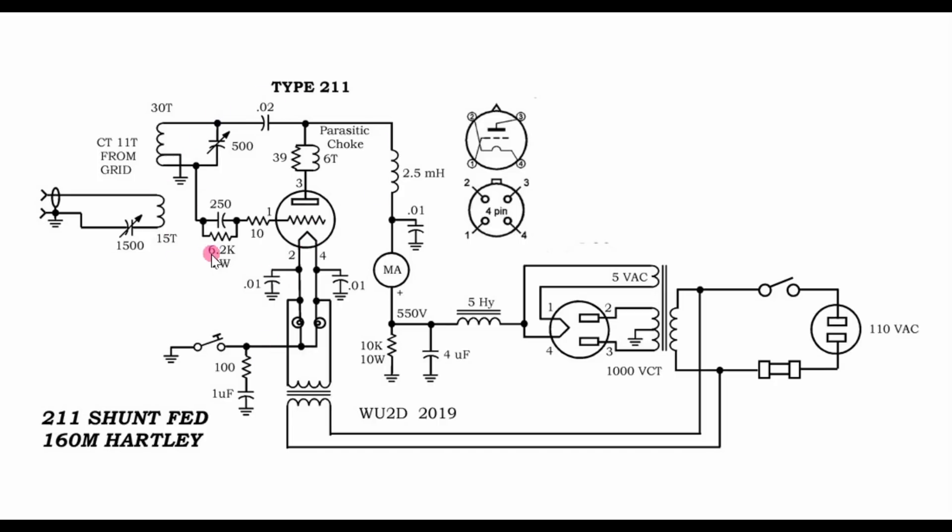This is actually a safer type transmitter than modern transmitters that use a pi output with a choke as a safety device. This 1929 circuit is safer because it's link-coupled. We're keying through the cathode — in this case, actually the filament — using the center tap. We have a little filter on the key for taking care of key clicks, and we have some parasitic chokes. The key click filter and parasitic chokes may be something grandpa would have dispensed with, and for the power supply I'm using a modern one for convenience, but grandpa would have used something a lot uglier — possibly jars full of goop to produce a rectifier or some type of generator system.